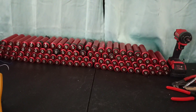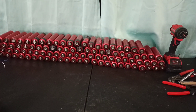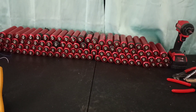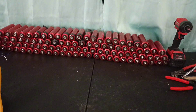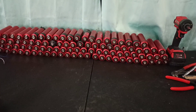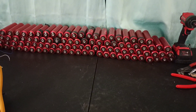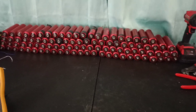We're back. Finally got both packs fully disassembled, checked all voltages on all cells, and taped up any parts of the insulation that needed attention. There are two different banks — the first bank has every cell at 3.44V, and the second bank, the one I was using for the last six months, is sitting at about 3.43–3.44V. Really close. These banks are actually sitting pretty close, so we're doing a top balance for 24 hours.